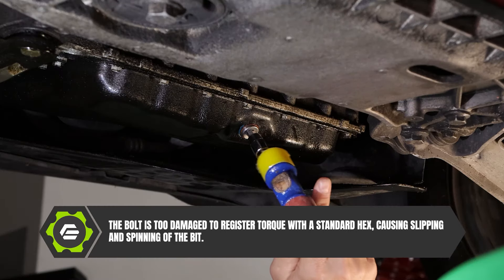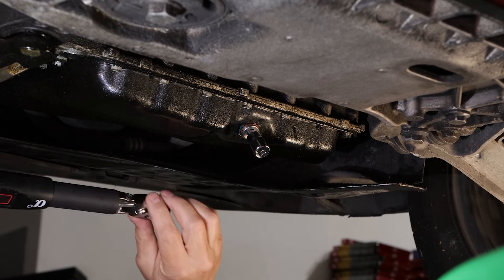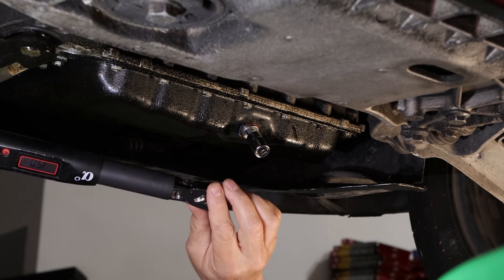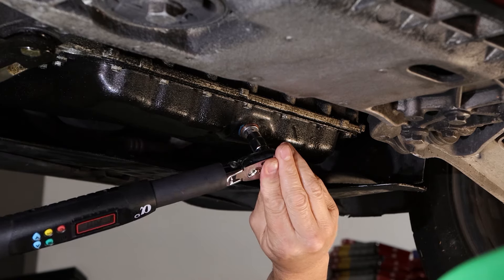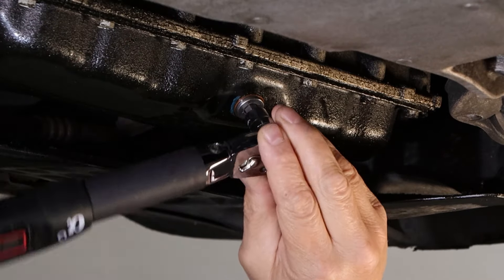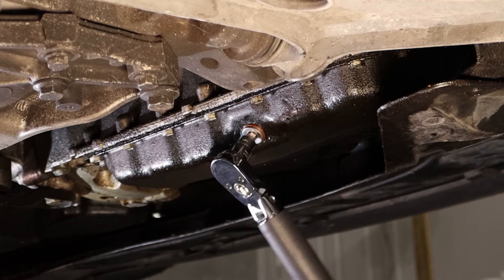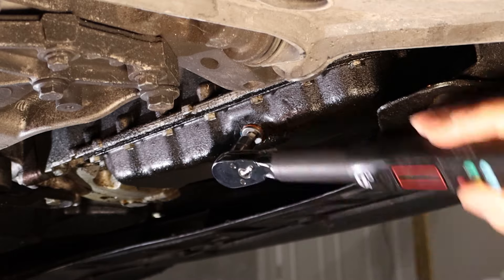Just to make sure that we're bottomed in, we're going to give it a nice little light tap with a hammer. Now it's important to know that I used a rubber mallet — a soft mallet — to hit that, because you never want to hit a chrome socket with a steel hammer as you can chip the chrome and damage the tool. I've got a torque wrench set at 15 foot-pounds to see if I can meter any torque on this. In the loosening position, there's absolutely zero torque being registered and you can see that bad boy is just slipping right over — no engagement whatsoever.